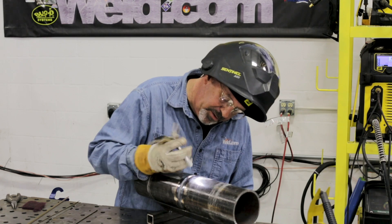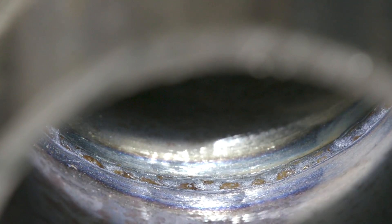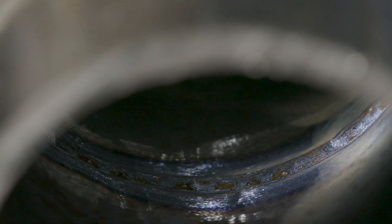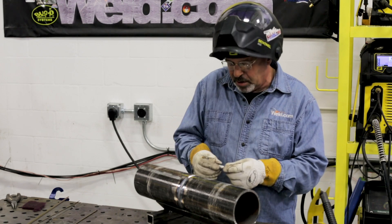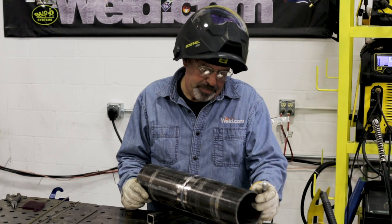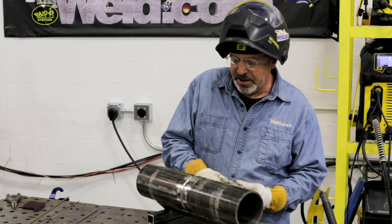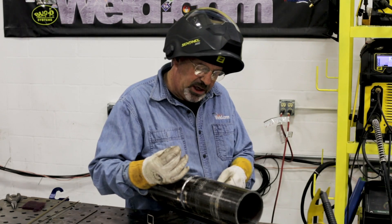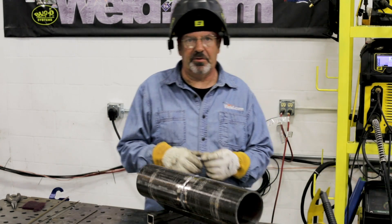I can tell where I came off of the leading edge and melted that — there's always a little bump in there. But the rest of it shows the edges broken down and some reinforcement. So we're fine, that is our goal. We want a little reinforcement and we want to make sure that we're melting edges. It's not so much about forcing it in there and blowing a big keyhole. That technique is about breaking down the edges of the pipe bevel and keeping the wire in there so that we can control it. That'll build your confidence when you're starting to weld these.